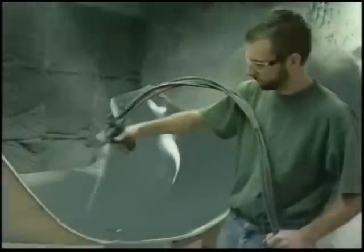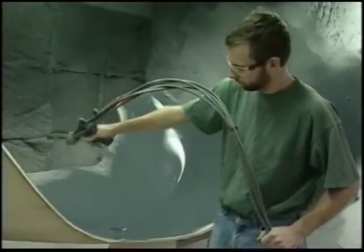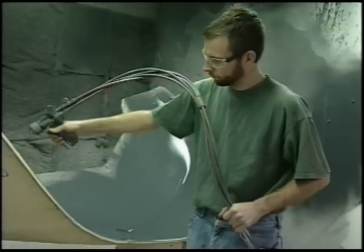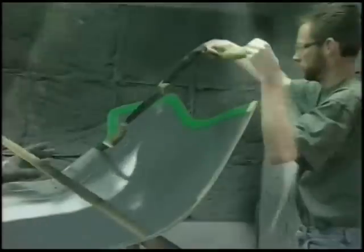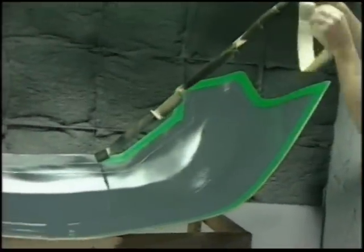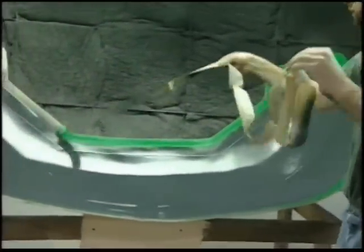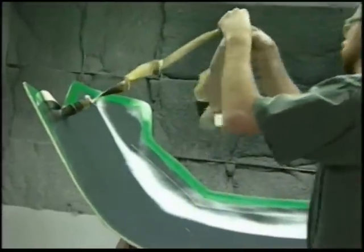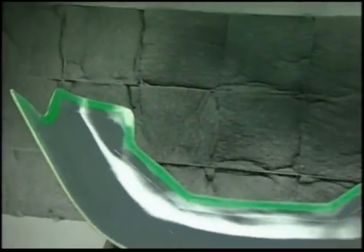However, using our Duratec products you'll have better impact resistance, which will yield fewer cracks, as well as reduced porosity versus gel coats. The Duratec primer is being applied five to seven mils, or 125 through 150 microns thick, which minimizes the weight addition to the body part, as compared to a gel coat which must be sprayed at least 12 mils or 275 microns thick to develop a complete cure.